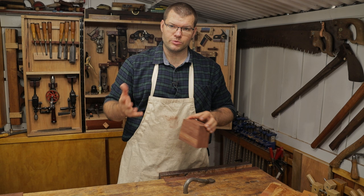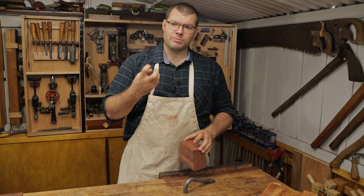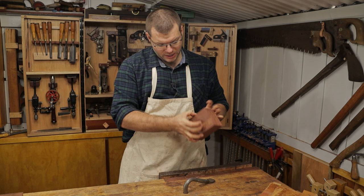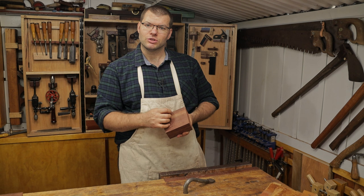So once that's done, I'll know how far down I need to come on the handle with making the round shank for it to fit inside the head, because I'm not going to make the entire handle that same uniform shape. It's only going to be the amount that's going to fit inside the head. And with an auger bit, because it has a lead screw, you need to have that allowance of that extra height when augering in, so you don't come in too far, because you don't want to punch through the top.